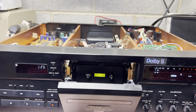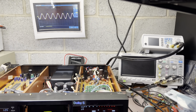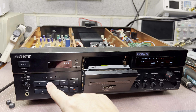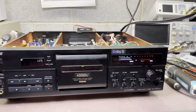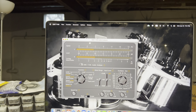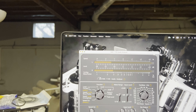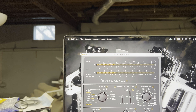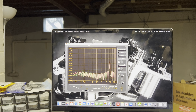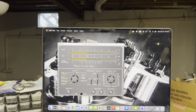That's why the levels were off as well when we were testing my frequency sweep tape. Now that we have levels set, let's check - I believe this side should go to about minus 10, and yes, you see minus 10 and it's minus 10 here. I may adjust a little bit. It's off - it should be like that. Now let's see - it's close, but for some reason it shows minus 40 here; I'm not sure why it should be minus 10.